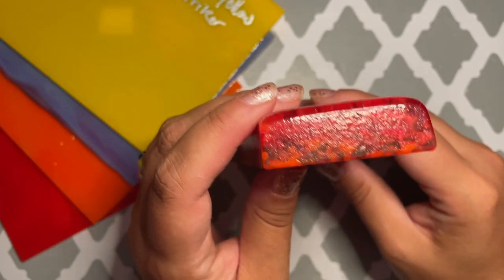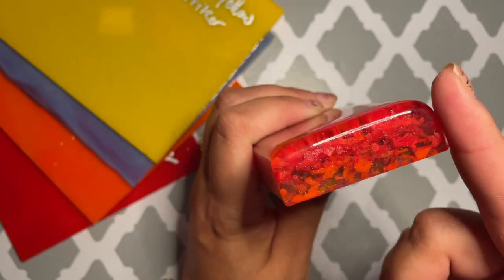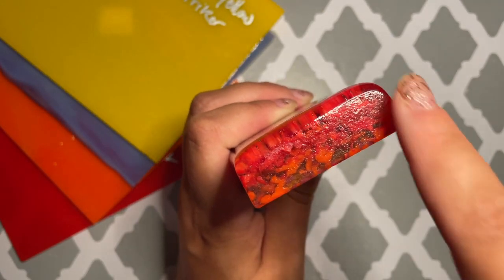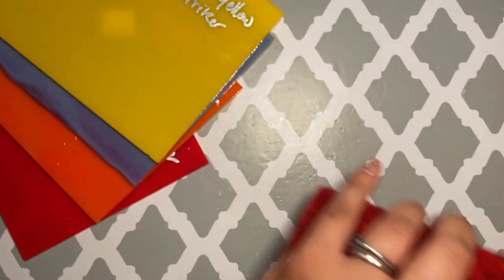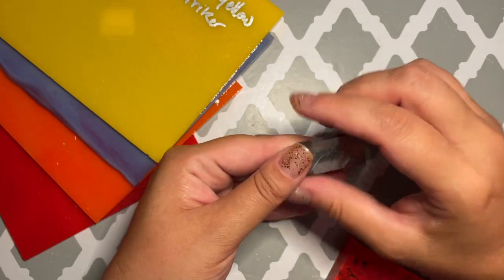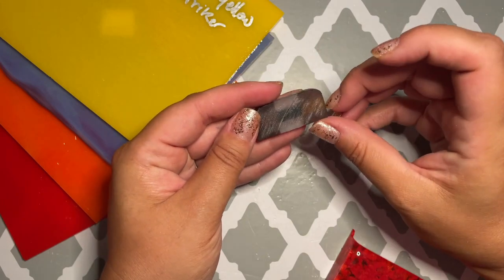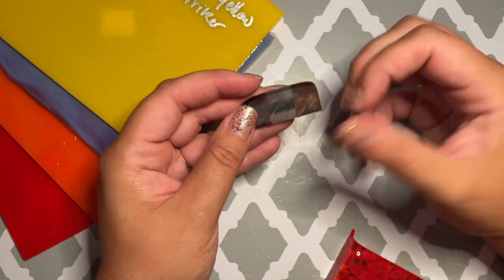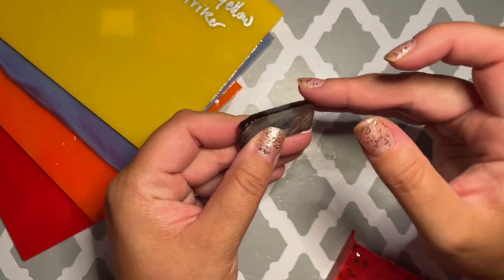So the first step to cut this pattern bar is going to be to square off these edges. You'll see the bottom is going to be at right angles, but the top over here is very rounded. And if I were to just cut slices of this, they would come out like this. So very straight bottom and a rounded top, because when it was fusing, it pushed into these corners in our mold, or to the edges of our dams. So that's why you have the sharp edges on the bottom, but the rounded edges on top.